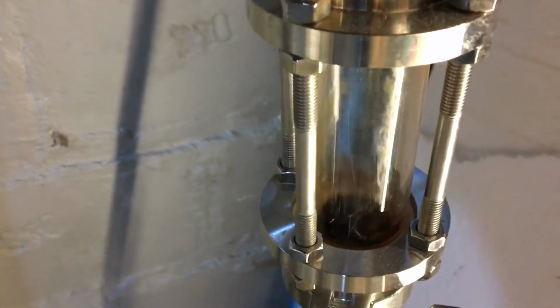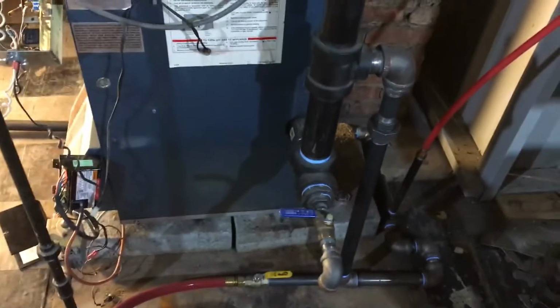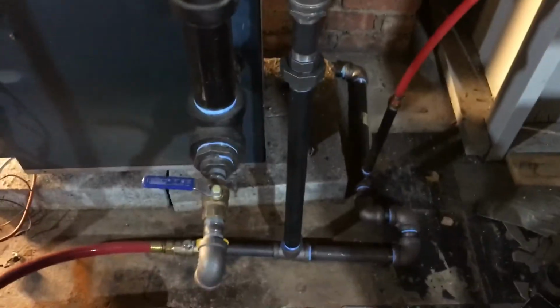It's about to drop. And the rate of the water condensing has stayed the same throughout this experiment, of course. That's the firing rate of the boiler. And it's been now 5 minutes. So 5 minutes, my leak has been leaking. You got 5 minutes. That's what the Hartford Loop gives you. So if that makes you sleep at night, I guess that's good, but I don't think the Hartford Loop is doing a damn thing.